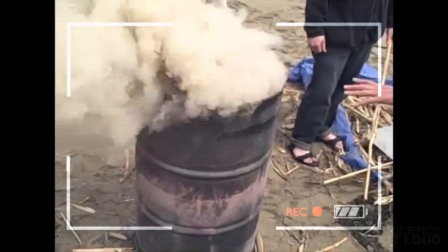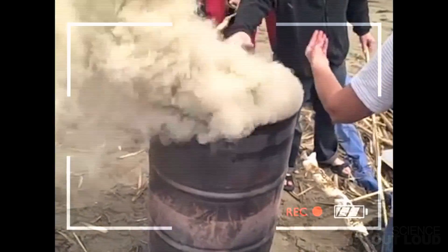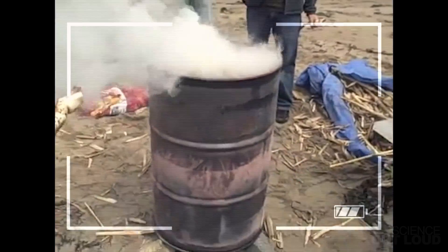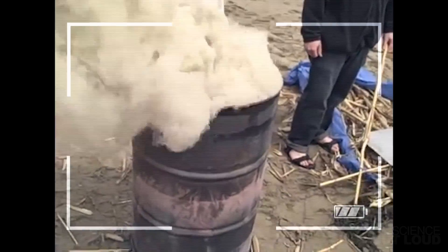Now that we've made the equipment less expensive, what can we do about making the fuel cleaner? If we can get all the smoke to burn off while the charcoal is being made instead of being used, we can decrease the amount of smoke released in people's homes. Leaving the kiln open for about five minutes at the beginning of the process will allow the smoke to burn off outside. So that's why we cut a hole in the top of the oil drum.